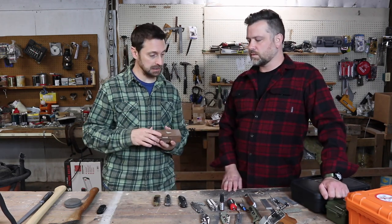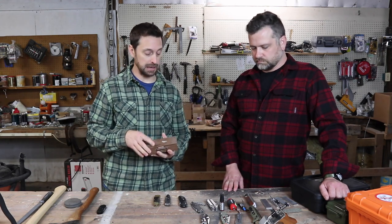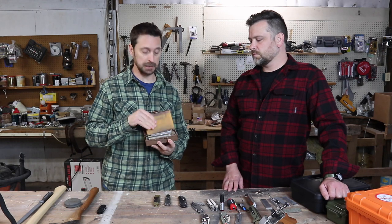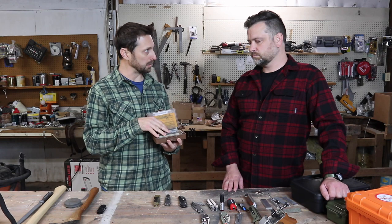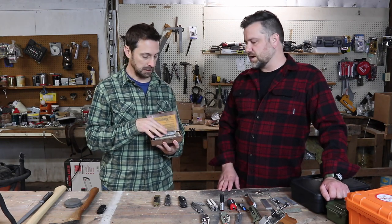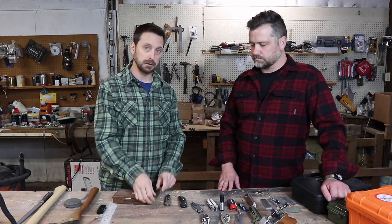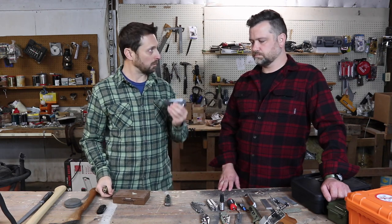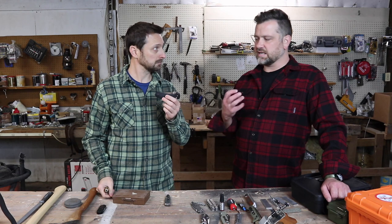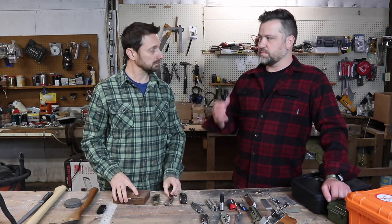This sharpening kit is also special to me — it looks similar to what Josh has here and it was my father's, also from the late seventies. It's got three stones — probably Arkansas stone, some kind of natural stone and bonded stone. This kit was fine for sharpening the older, softer steels, but it's not going to work well for something like this S30V. It's not going to get into those carbides like you need to because they're so hard — you need that diamond to shape them.